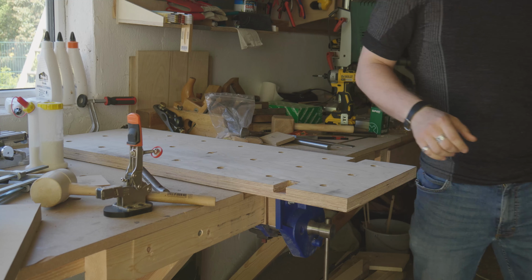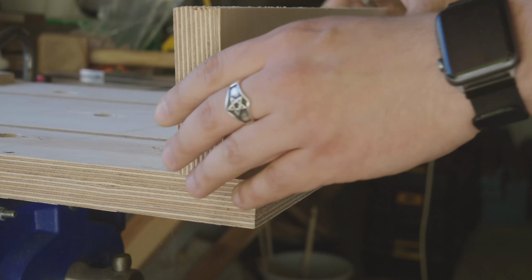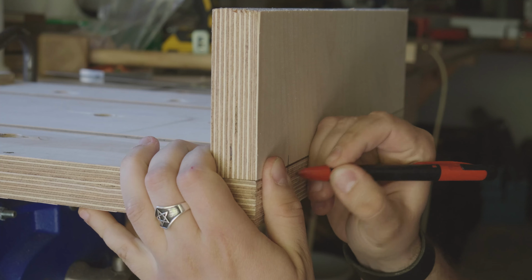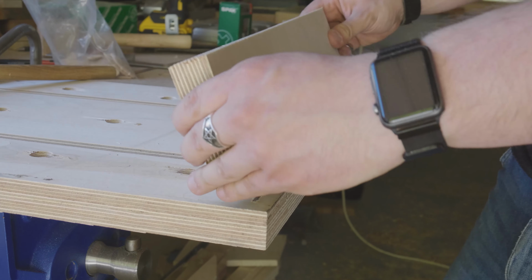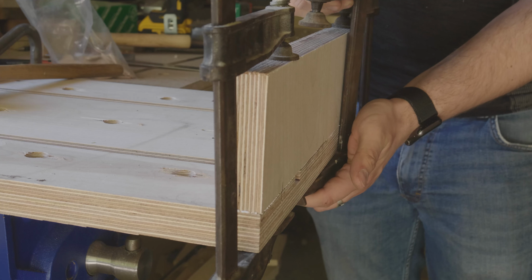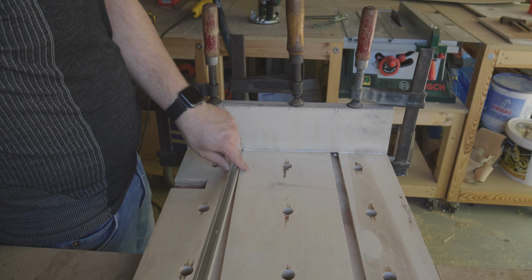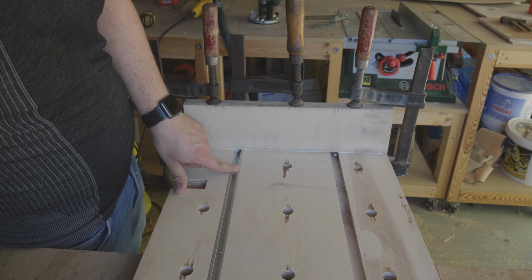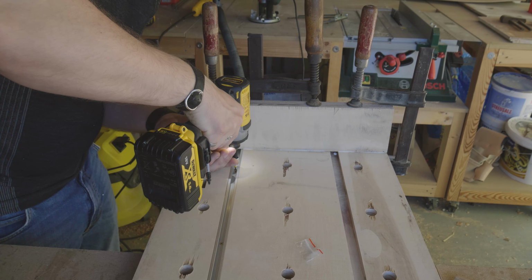The remaining bendings are still missing. Here the procedure is the same again. Mark the biscuit joints on both parts, mill, glue, insert the biscuit, put them together and clamp it together. While the glue dries, I can now screw on the C-rails. It is important that the screws do not protrude even a little bit, otherwise the clamps could get stuck on them later.